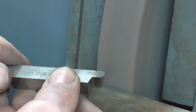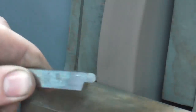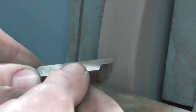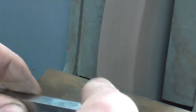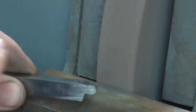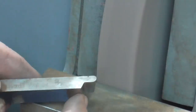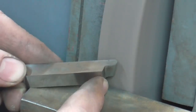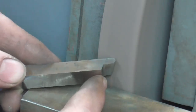When I come back to address errors found with the radius gauge, if I just plunge straight in and try to grind it you invariably end up with all kinds of different rake angles. So what I like to do is, in the spot I'm working on, tip the tool slightly towards me, feed in until it just clips the wheel, and then bring the tool up to the wheel. That way you match the tool's rake angle with the wheel angle and you produce less of a noticeable dig in. I'll do it again in slow motion — I'm bringing the bottom of the tool into the wheel, and as soon as it clips I'm tipping the tool up and then addressing the spot.